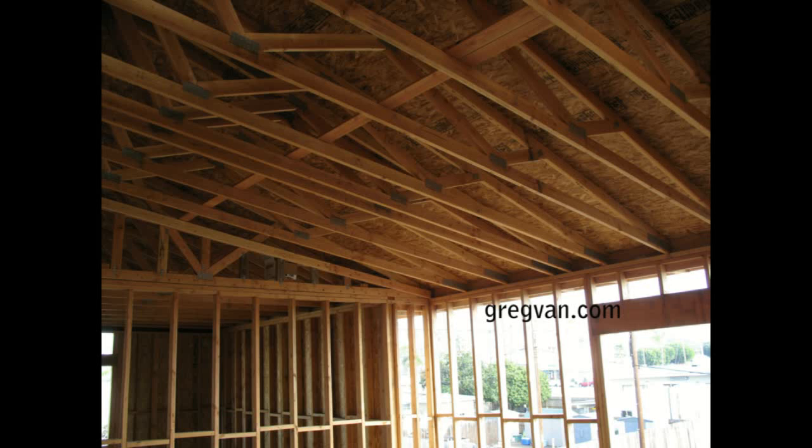I'm not going to show you any pictures of any wood trusses that have been cut. This video is just to inform you not to actually ever cut them where they cannot be cut. Which realistically, in most cases, wood trusses can only be cut at the eaves or the fascia boards — the part of the truss that overhangs off of the exterior wall.